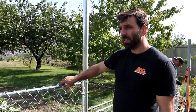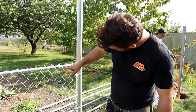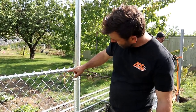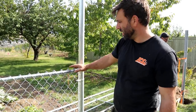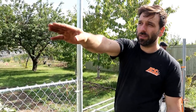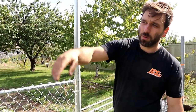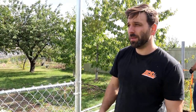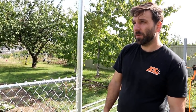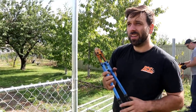We also have to make it so that half of the mesh of one of the links is above the top rail. So we have to dig and kind of shift everything around so it's all even all the way across. Because if you look down the length of the mesh, there's a rise where there's a bunch of dirt lifting the mesh up. The way that you make the fence look good is if all the lines are perfectly straight, and that takes some finagling. But for now I'm just getting the mesh up in place.